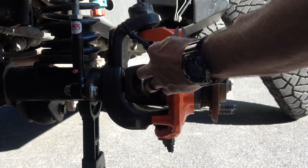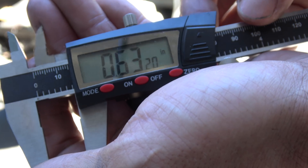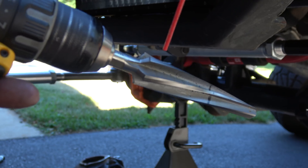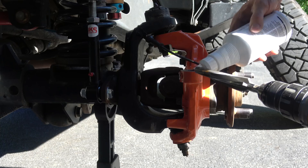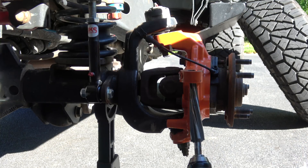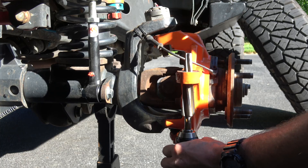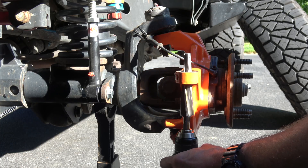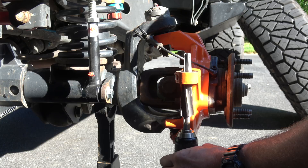I'm going to shoot for 0.6460, the same I got on the last one. Starting out at 0.6320 on this one. A little WD-40 just to clean things up. Make sure it's pushed all the way in there straight. If you can go as slow as possible, you're basically just shaving and widening an existing taper.